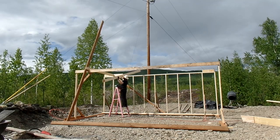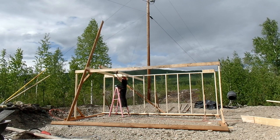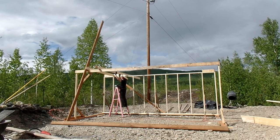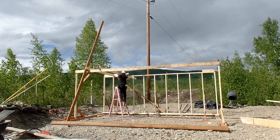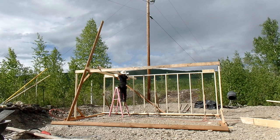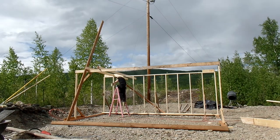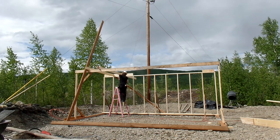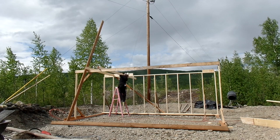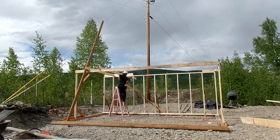So the first set of joists and spars is up. Here's how I set those joists in there - they essentially get nailed to blocking standing vertically in the back. I love a pneumatic nailer. The joists really can't go anywhere at this point; they're sitting between the temporary wall and nailed to the blocking. The blocking is both glued and nailed into the top plate of the wall we put up last video, so overall this thing is pretty solid.